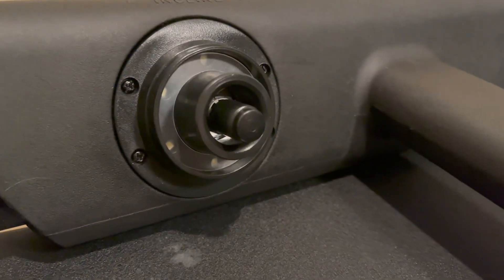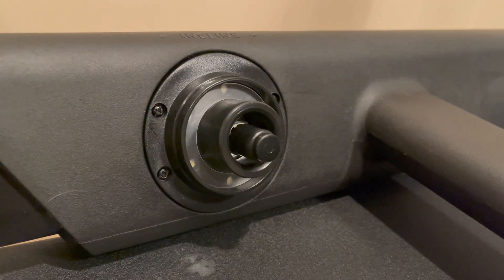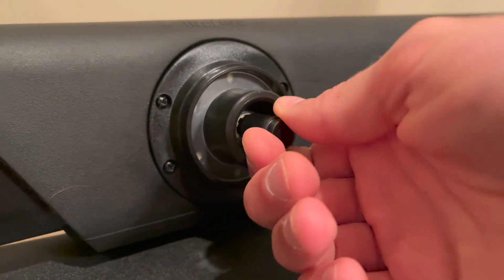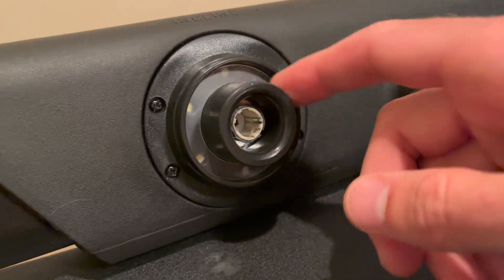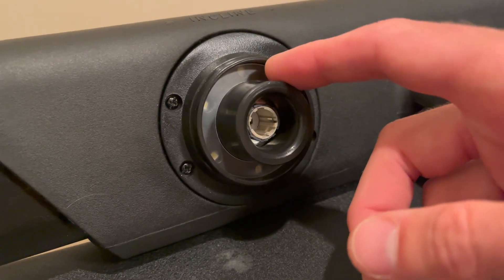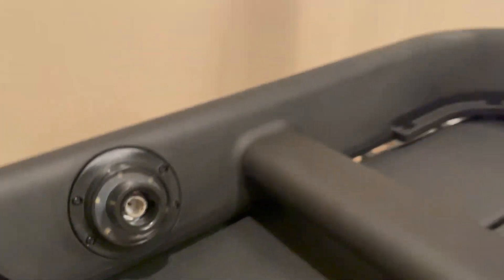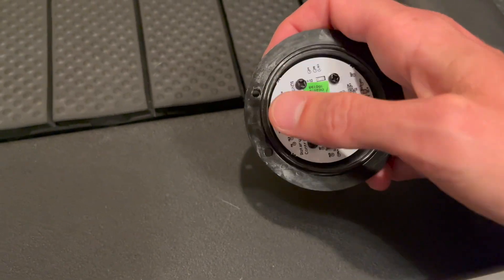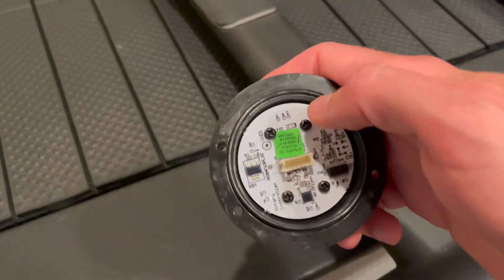If you do find that you need to remove one of the knobs, you basically pop the knob straight off. I used an automotive trim tool — I can link that in the description. From there, there's a little joystick switch thing you have to take out. Be careful — there is a little diffuser for the LED lights. Don't lose that. Then remove these four screws and the whole thing pulls straight out. There's also a rubber o-ring that goes around — don't lose that. Take out these four screws and you can remove the PCB board and replace it. It's fairly simple.